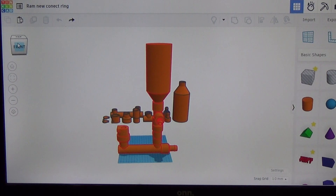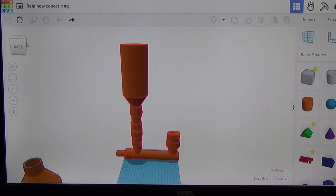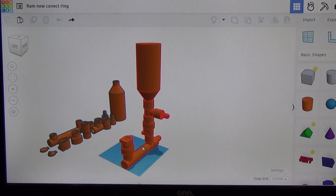Let's go around the pump so you can see the whole thing completed. You can see the pneumatic trap tank up here that acts like the pneumatic spring to push the water uphill. You can see we've got the two one-way valves — one right here and one right there — that we're going to 3D print both the case and the flapper for. Here's the input pipe bringing water into our system, and we've got our output pipe right here.